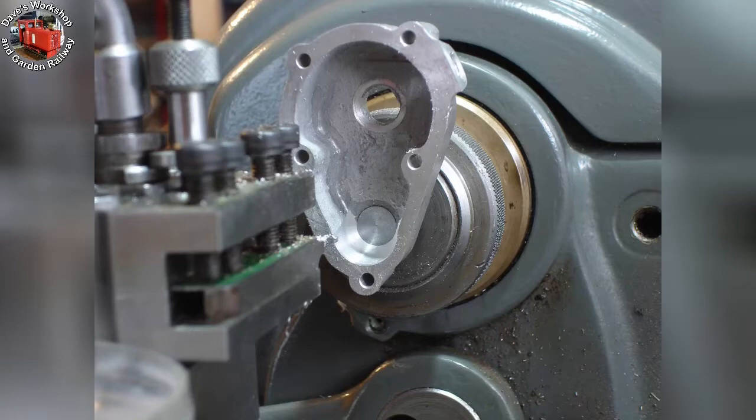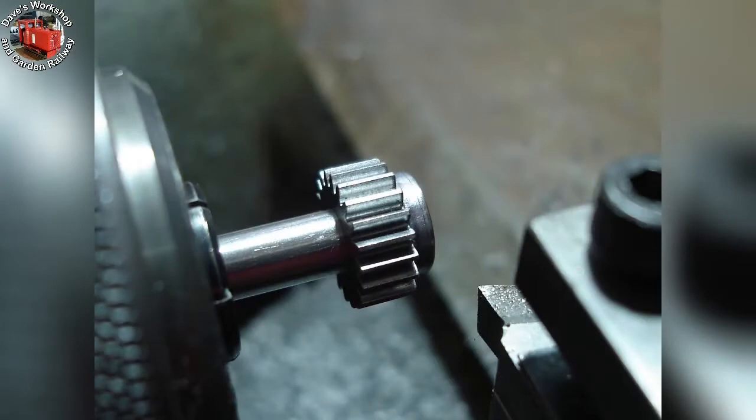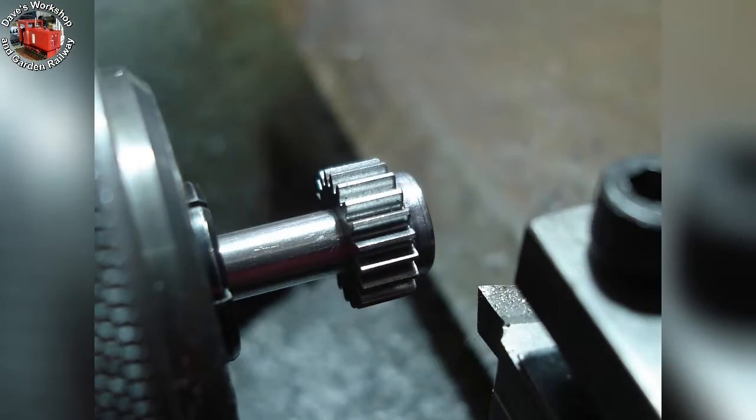The timing case is superglued to a piece of 3/8-inch rod — it held okay; only light cuts were taken. The steel gears were supplied with a long boss which needed facing to length — here one is superglued to a 1-1/4-inch rod. The toothed portion is 7/32nds inch as received. The gears are SH Muffett 20DP gears.